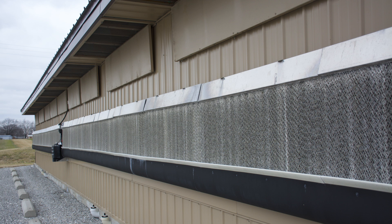When the temperature outside is above the thermal neutral zone, we provide cooling through evaporative cooling. We have what we call a cool cell, where water drips over a piece of corrugated cardboard. If the temperature is too cold even with minimum ventilation and there's not enough body heat from the pigs, each room also has a gas heater.